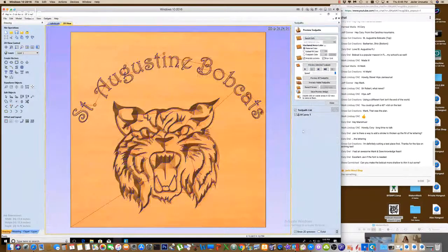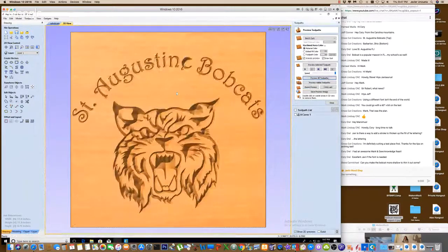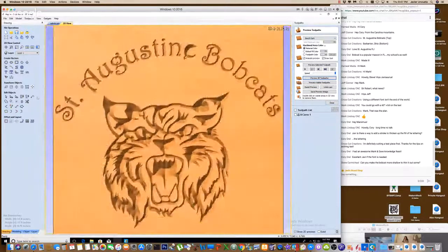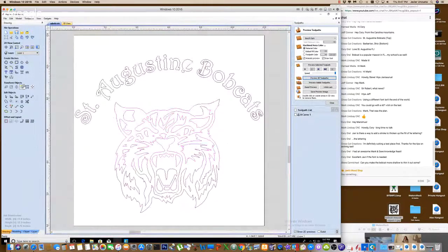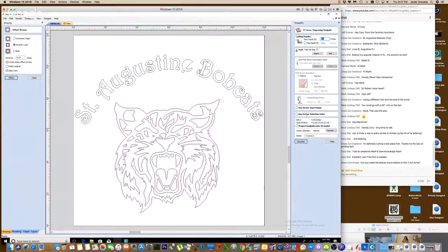And yes, you could make it thinner, Steve. Okay, so as you see, obviously that E is a mess, but these letters are far thicker than the original. Now, if you want to thin the Bobcat out, you could again choose the entire thing and offset inward, delete the original, or rather select new and offset, and try to V-carve that. Let me put a new V-carve on this.